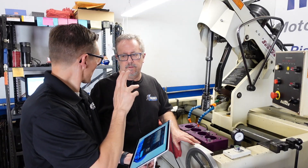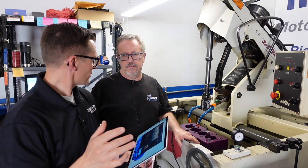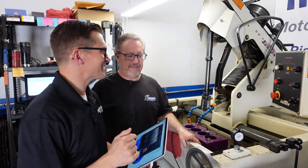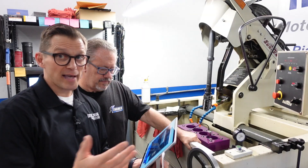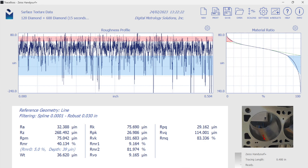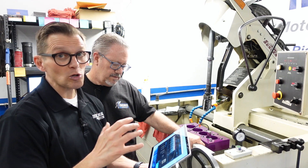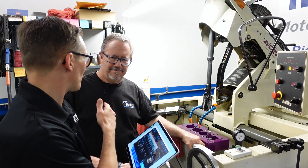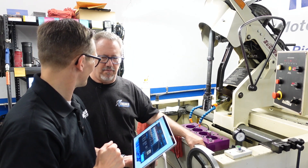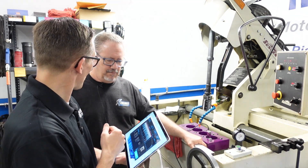After about 15 seconds of plateauing strokes, we check it — that's the smart way, creeping up on it rather than jumping to the end. With the old machines you have to creep up on it. Measuring now: the Rz came down from 500 to 268. Rvk is 101, Rk is 75, Rpk is 26 — still a little too rough, but we only went 15 seconds. That was the first creep. Probably about another seven or eight seconds needed.